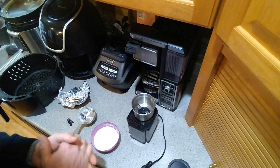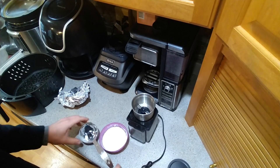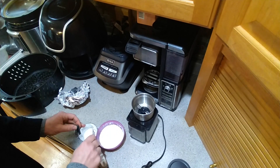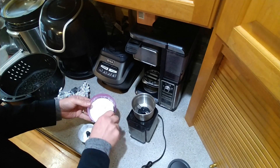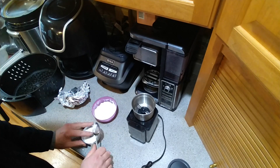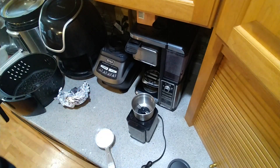I'm going to take this part and put it in a metal container — this happens to be stainless steel, but you could use aluminum or whatever. I'll put a little salt on the bottom so the part has some distance from the bottom, then fill it up with salt and get the part in there really deep.